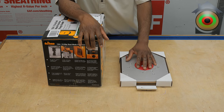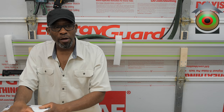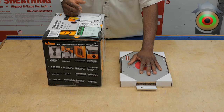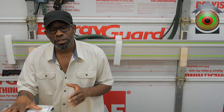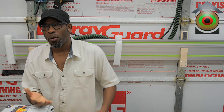It will be bolted, not screwed like you saw before, because I need it to be robust. Both of these manufacturers were involved in the initial setup. The router currently in there is this Triton model — the previous iteration. The router plate is from Woodpecker and was designed for a router like this as a lift system. I had some issues with depth and the lockout system because of the plate thickness.